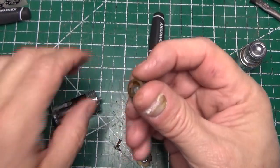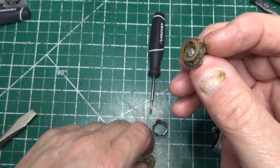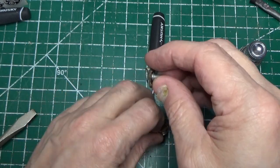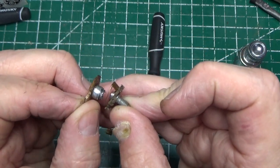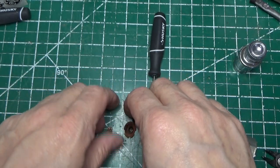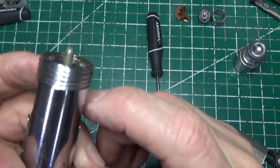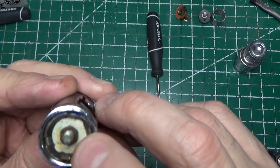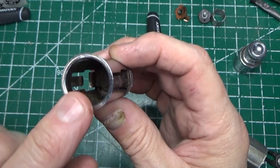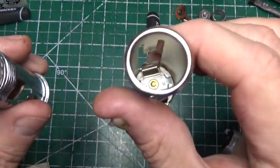I think the fuse is really nothing more than this piece of copper that attaches to a brass ring that sits inside the fuse. I've got it all taken apart at the moment. If you exceed the current draw, it'll just pop that fuse. We've got it apart and we can put it back together, which is good — so we'll keep that to the side. Here's our socket — if I'm correct, I can remove that screw down there and pop out the inside, then replace those parts with the replacement.